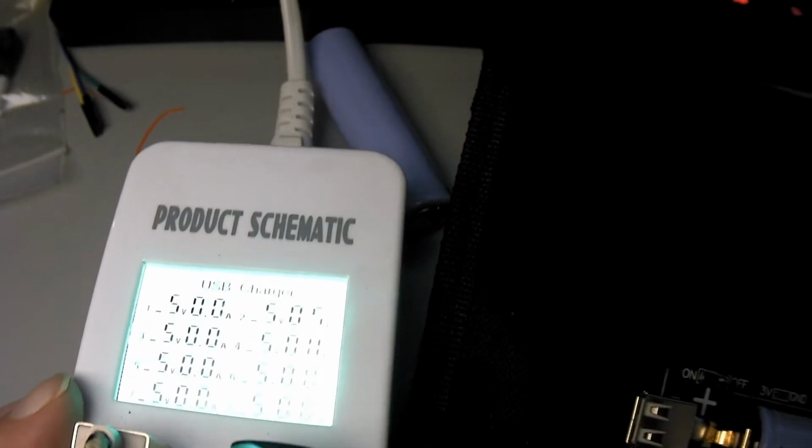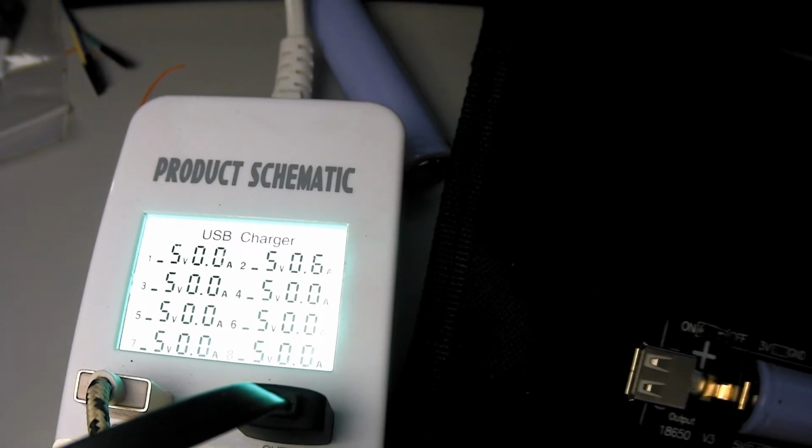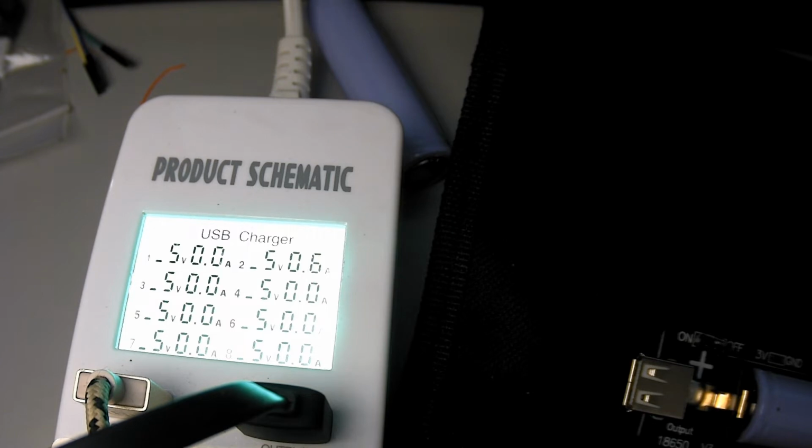So right now this battery is a little bit discharged, and we're pulling 0.6, so 600 milliamps is going into the battery right now, and that's great. But remember, we had about 200 milliamps that we needed to run our LED, and a Raspberry Pi is going to be much worse than that. You might be pulling above an amp, or 1.2 amps, or who knows, or it's variable.